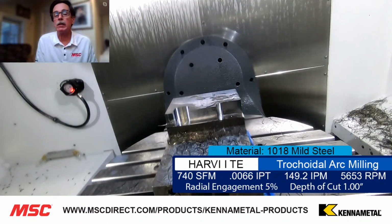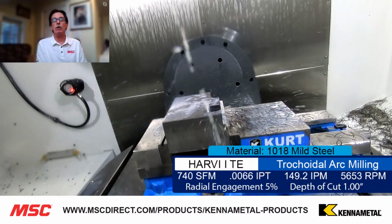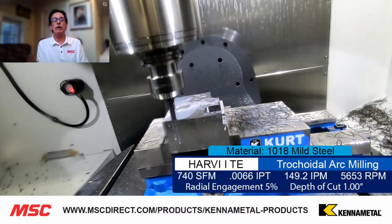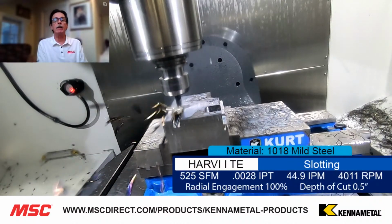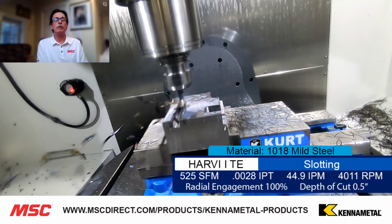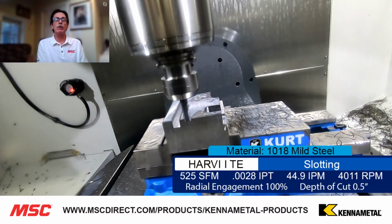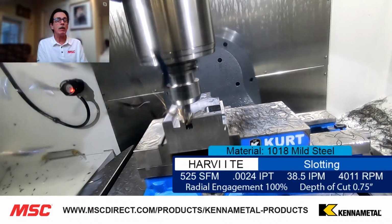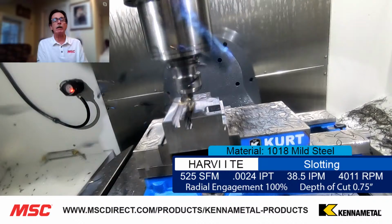Well, the capacity is being able to do things more aggressively. The Harvi I is a great tool, and I highly recommend that. But here's a good demo and a good example of that. That's a full diameter depth, which you could do with the Harvi. But when you start getting into 3/4 deep, like you're seeing in this cut here, most tools won't do that comfortably.